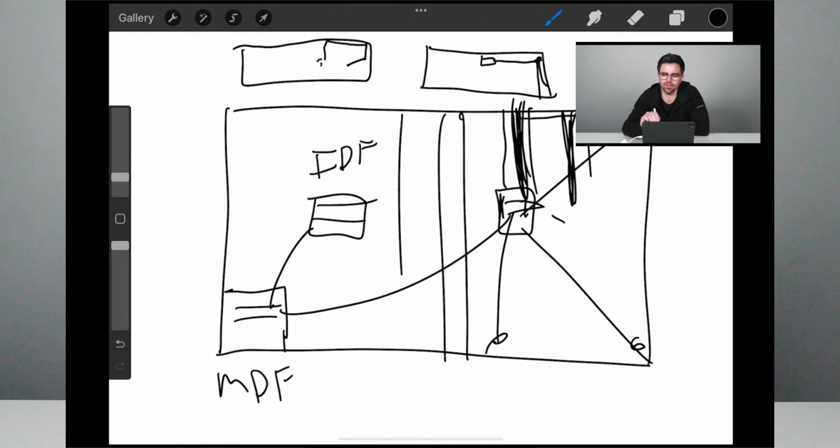Now when we look at our drop locations, we want to think about how many ports do I need in this IDF. You also need to think about how many APs you have. If there's any video surveillance in the warehouse, that's going to take up ports. Sometimes as you're looking at the network design, you may just count up the network drops and go a 24-port switch will do — and then not think about the seven cameras in here. You may need more ports. And then we've got wireless APs too — seven APs over here. It quickly adds up.